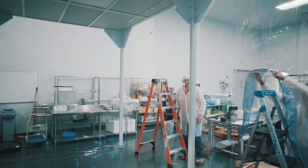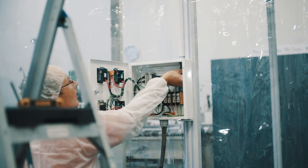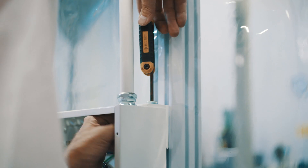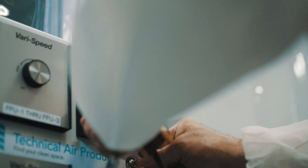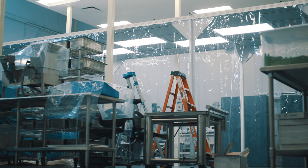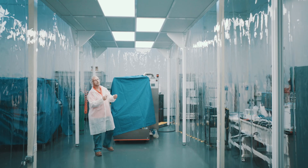The electrician runs the main power supply to the unit. In one New York installation, it had a power cord, so the electrician just set up a 220 outlet and the control panel attached directly. The doorway uses 8-inch wide overlapping vinyl strips. Curtains around the room overlap 4–6 inches between panels on the J-Track. The room can also grow with your process — you can remove a curtain section, add more extrusions, legs, HEPAs, and lights to expand the room in any direction.